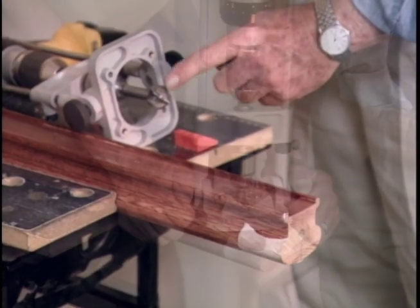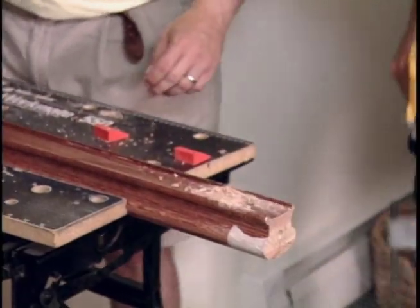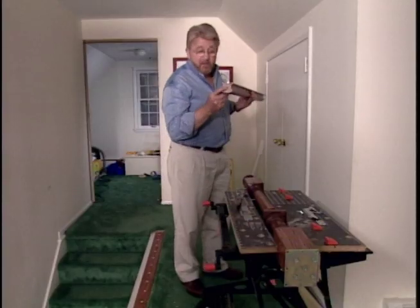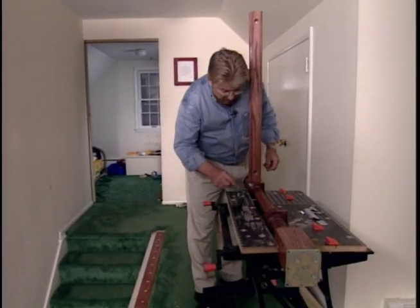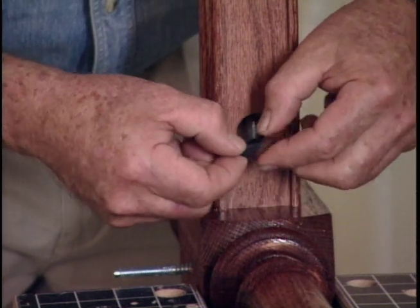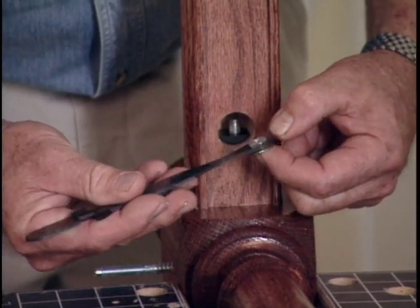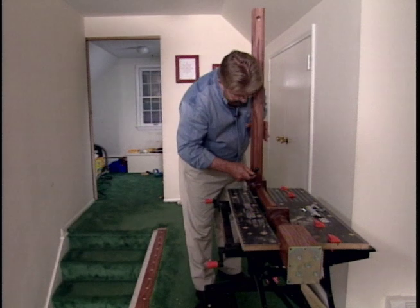Using a larger one-inch bit, I drill a second hole into the bottom of the handrail that will intersect the first. Now it's time to connect the railings to the newel post. This is the hanger bolt that we put in earlier. This is the hole we drilled in the end of the rail and the larger one we drilled in the bottom. We'll slip this hole over the hanger bolt like that. Inside this larger hole, I'm going to slip this washer — it's got a convex surface that will form to the edge of the hole, giving me a flat surface on which to install this combination nut washer. The best way to put this in is with this special wrench that comes with the kit. Slip it in like this and then we tighten it up.